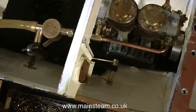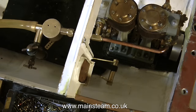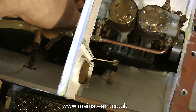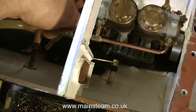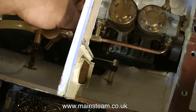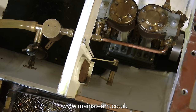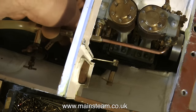Time now to test it. This steam engine does not need much pressure to work. I haven't given it enough pressure at the moment, so I'll open the regulator, give it a little bit more, and off we go — it's quite nice. I move the reversing lever, and not unsurprisingly the engine immediately goes into reverse. It's moving in forward and reverse and it's not too noisy — quite sweet. Bear in mind the engine is sitting in a big hollow metal shell, so any noise is going to be amplified somewhat. The entire boat is sat on my elevated soundboard — a piece of plywood that sits on top of two metal bearers screwed to the bench, spaced at 7.25 inches for 7.25 gauge locomotives, which I work on periodically.